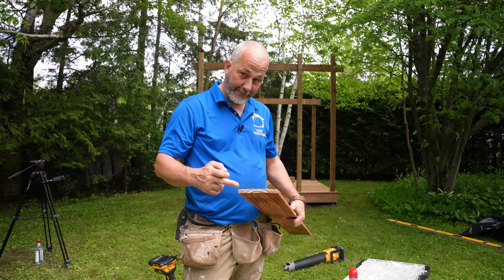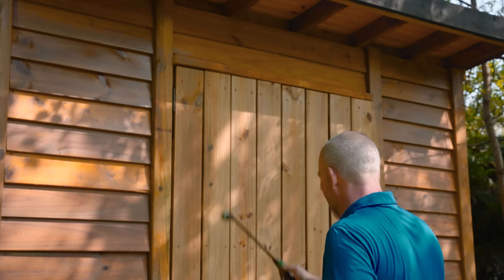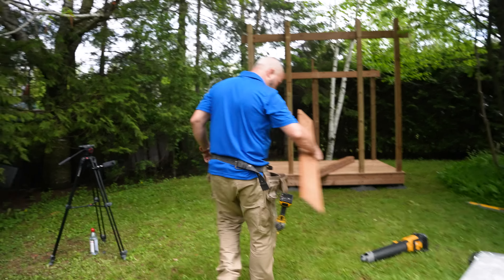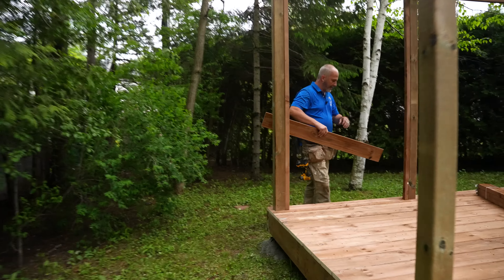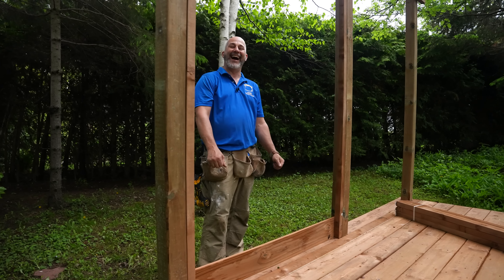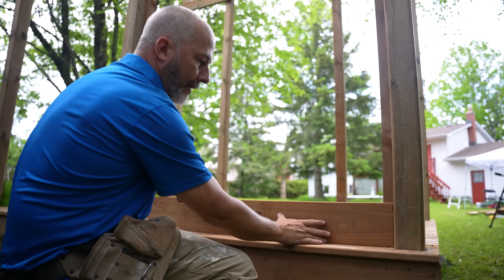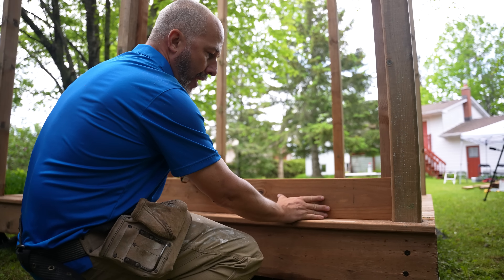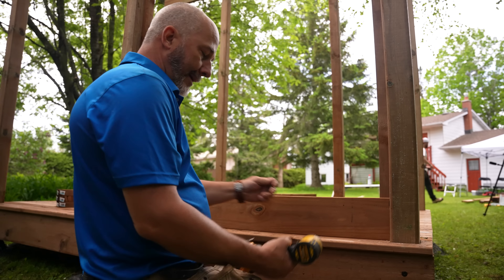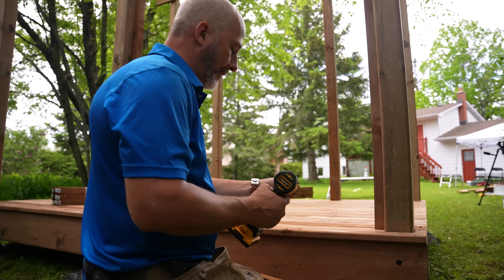This is an exposed edge. We're going to use a spray sealer — when we put the stain on it's going to be under compression and that should get all the material it needs. Let's throw the first board in and I'll show you how this works. When I'm tight against the left side, this is the gap I have to play with, so I'm going to split the difference a little bit. Because it's the first board and there's no overlap on the bottom, I like to do this to create the overlap.